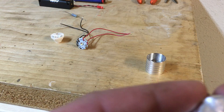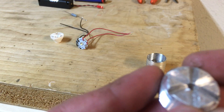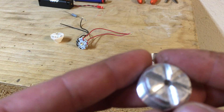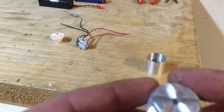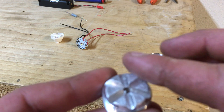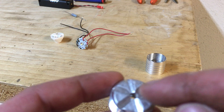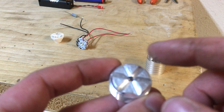I buy the three-up versus the one-up because I know I'm going to be doing my notching anyway. The difference is a three-up has the hole in the center and it's flat, because on a tri-Cree the LEDs are around it and you have the hole in the center.